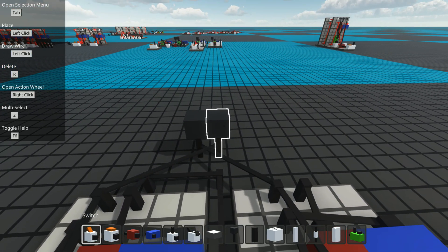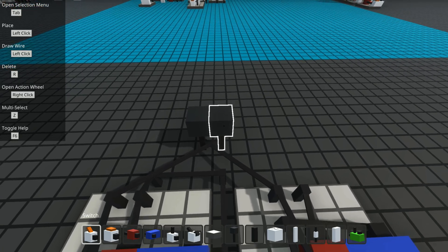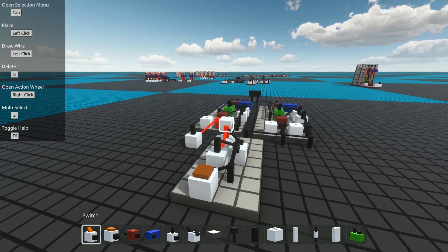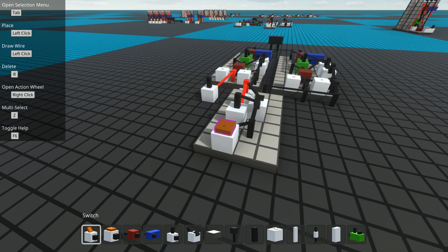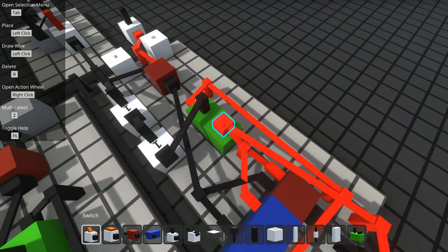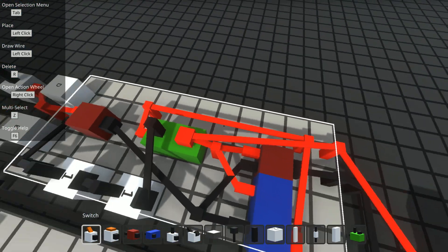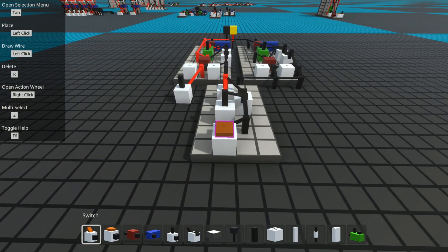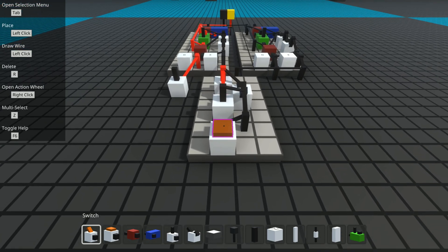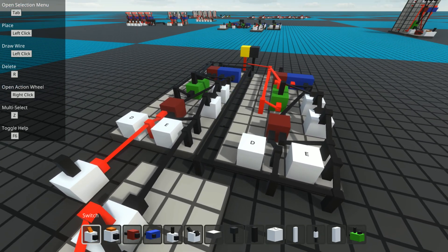Every time I click the button it adds one. Right now it's zero, and the output is on this right display. I have a two-bit display — the least significant bit is on the right for the left board. So the left board goes to the right display. I hit the button and this goes on — you can see the D-latch is set, driving that display to be on. If I click the button again it's going to add one, so the D-latch will go to zero and send out a carry signal.